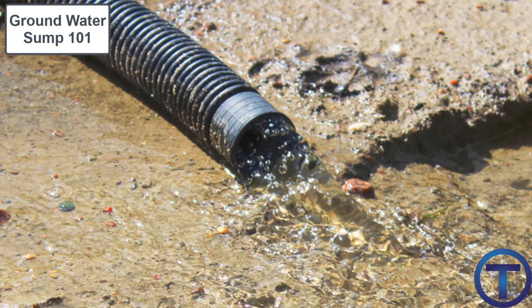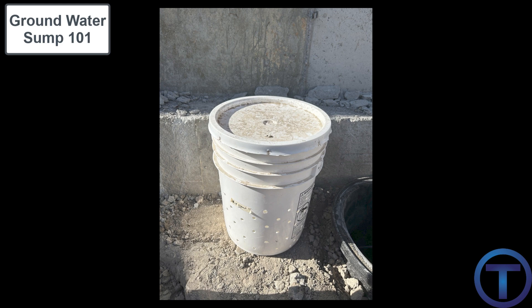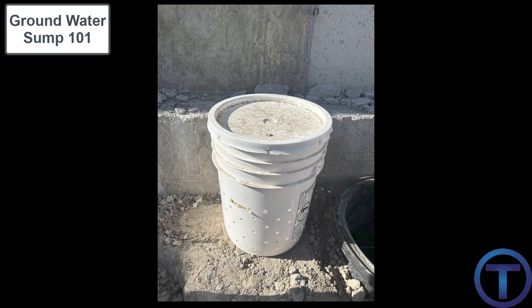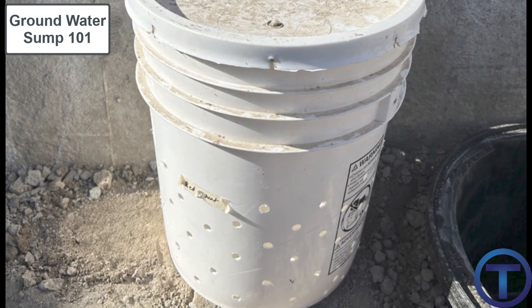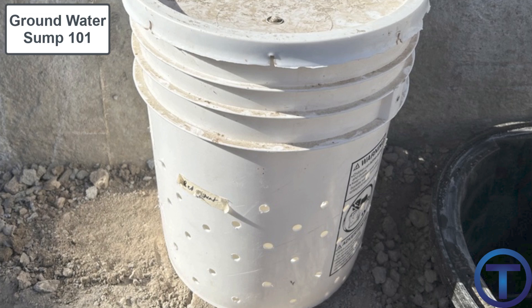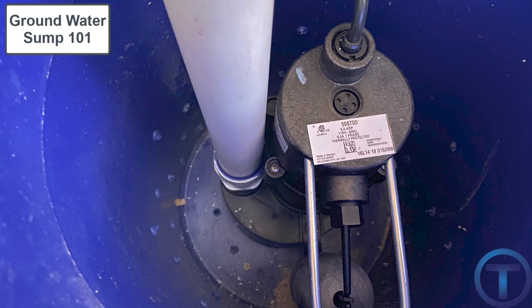When it comes to the sump itself, you can purchase a manufactured sump tank that you sink into the ground — requiring a hole deep enough and wide enough for it to be recessed into the floor. Another simple, affordable option is to take a five-gallon bucket, drill a bunch of holes in it, and set it down into the floor. Technically, that bucket is not large enough to meet code, which requires 18-inch diameter and 24-inch depth, but it is big enough to handle most pumps used for a groundwater sump.